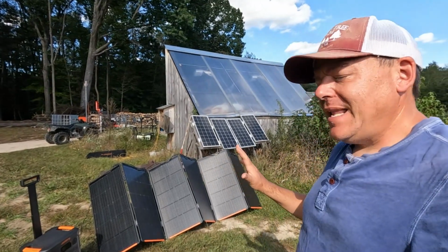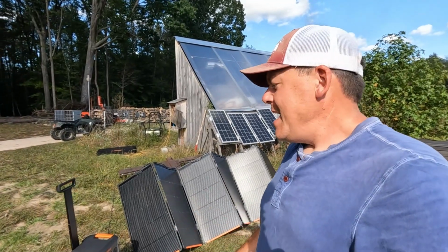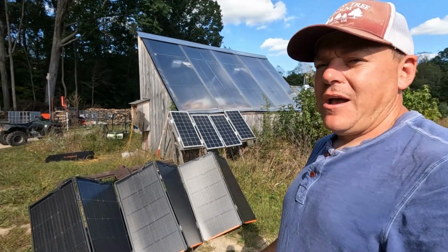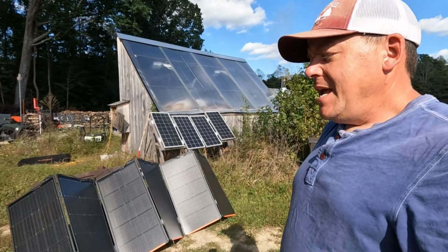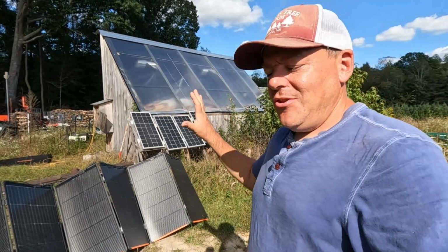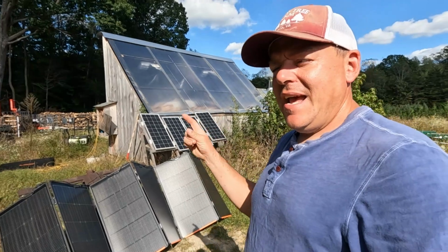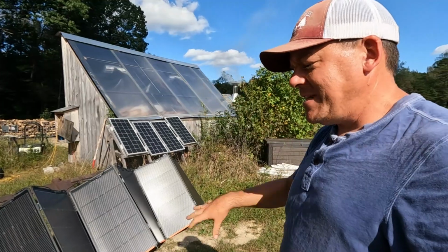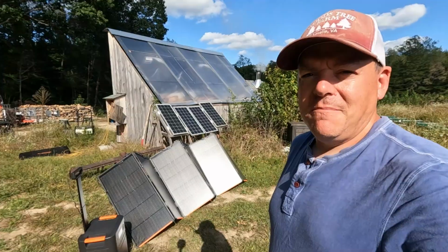Not completely. Last night I came out, or excuse me, this morning I came out, it was at 16% remaining. Now after charging most of the day, and we still got a couple hours of sunlight left, it is back up over 40%, which is enough to get through another night. And if we had one cloudy day, we would probably need to turn those fans off because it would exhaust the battery and not be able to keep it up. But 75 watts of fans running 24/7, 2.5 days straight, this thing has had no problem keeping up.